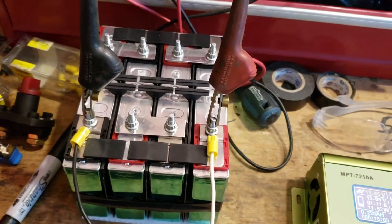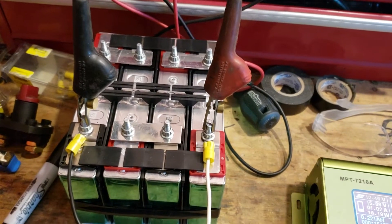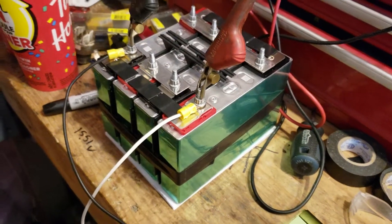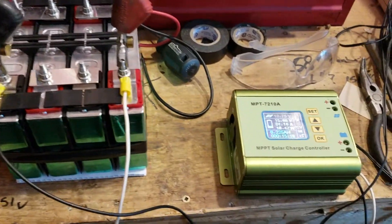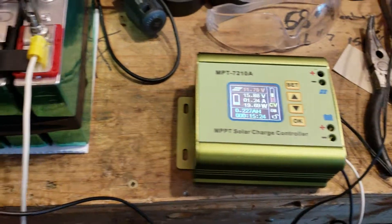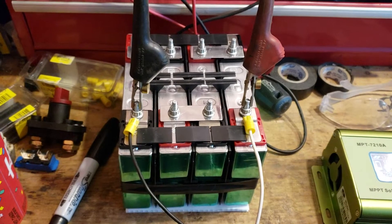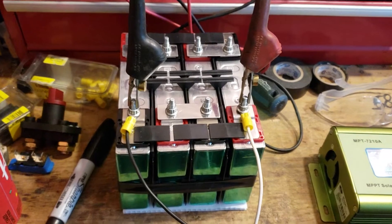For this video: Panasonic 3.7 volt nominal lithium-ion cells in a 4S configuration. I have a BMS on there right now, and all the cells were balanced before I started. I'm putting so little current in — just 1 amp — so I'll check after to see if they charged up the same. I'll worry about balance charging when I get a BMS with a balancer to put on this.